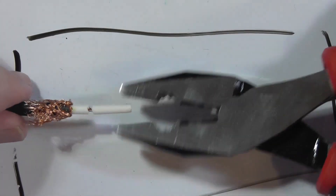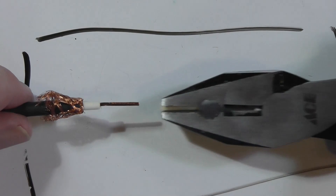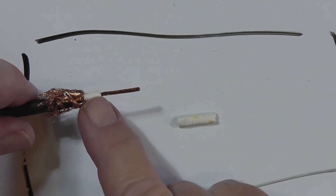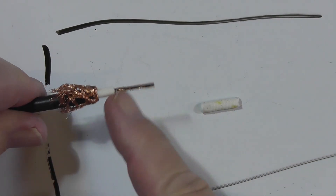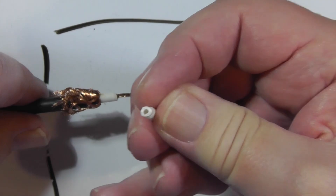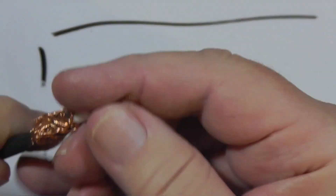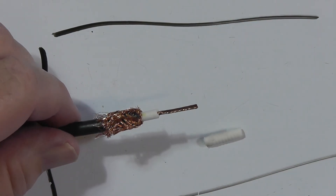What I had suggested was to grab the end of it and try to pull it off. That does sort of work, but here's what he suggests: take this part here and squash it this way, then turn it 90 degrees and squash it this way, and it just falls right off. So here's a method for getting that last piece out — just gently cut down to the copper, don't cut the copper, then squeeze it. It becomes a little oblong and pulls away from the stranding on the wire, and that thing just fell off when we did it his way.